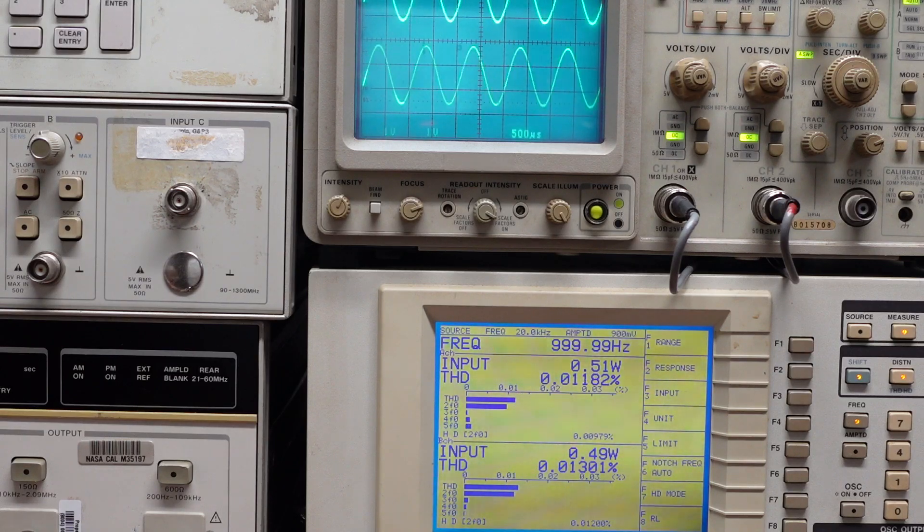The question I had is why did that diode fail? It could have been when that guy monkeyed with the bias, or it could simply have been infant mortality — it was a new diode among all the new diodes I had put in. It could have just been from him playing with the bias, or it could just be a part that failed. Anyhow, I'm going to run this amp for a few days and have fun doing it. As always, I enjoyed making this video and I like giving back to the community that has given me so much. Thanks a lot folks, have a good one.